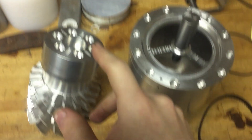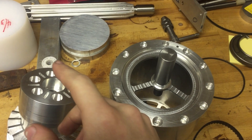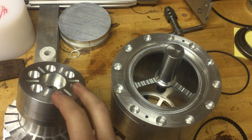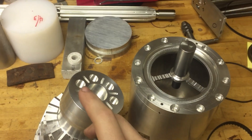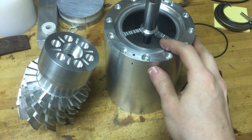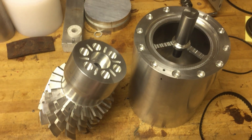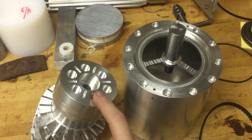It works well. The bearings are a little noisy, but full ceramic bearings, I think, are always kind of noisy — they're so stiff, it just transmits all the noise and gets loud. So I'm not sure if that means the bearings are damaged already or just low quality, or if it's just the nature of the bearing. I didn't have a tachometer and I had no idea how fast it was going, so I'm going to try to get a tachometer set up.